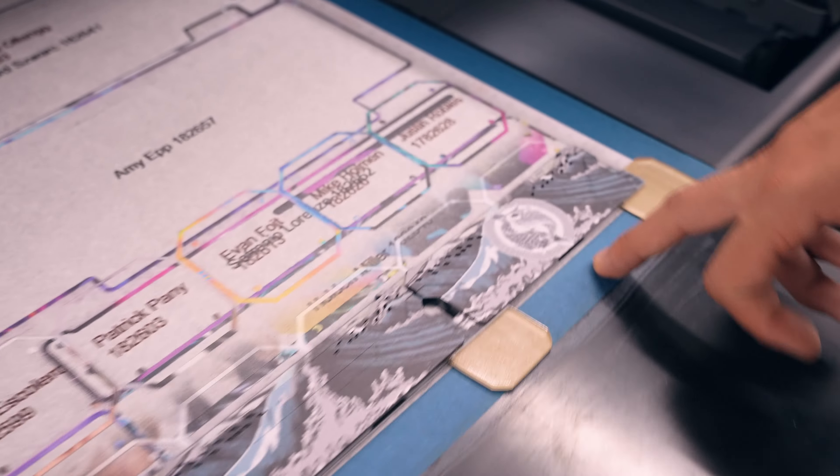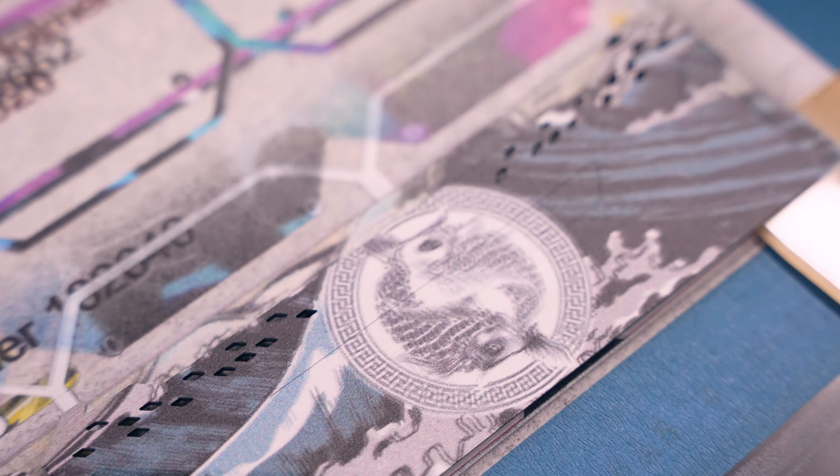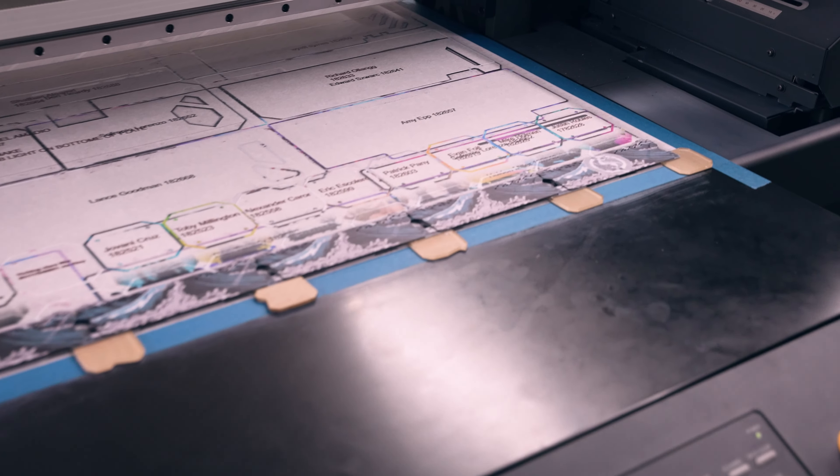The quality on the print just was not there on a lot of these. It might be kind of cool to be not super in-focus on some, but the main focus piece just did not turn out hardly at all — that's what happens when you're too out of focus. I went super tall on the print height just to be on the safe side, rather than cause thousands of dollars in damage. But the problem is now we're going to have to do another white layer and another print layer on at least this specific one. It's definitely a learning experience — we're going to redo two white layers and then throw another print layer on it to get the exact measurements right.